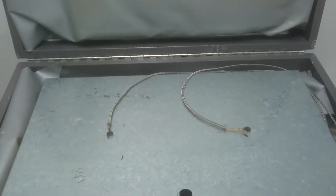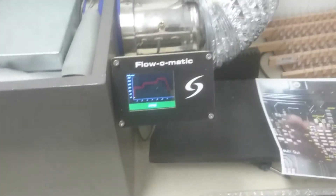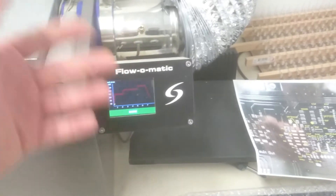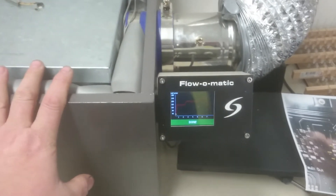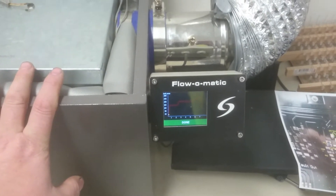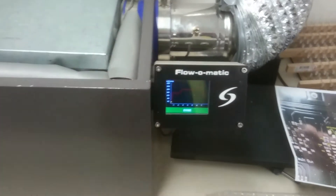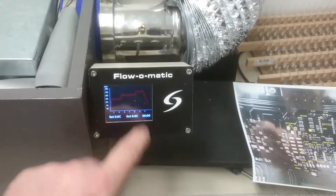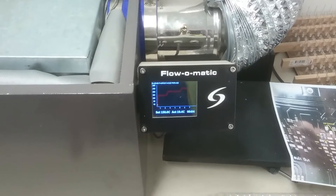That's just about it for the heating element. Here, we built a PID control for this because we had these little touch screen modules. I just used a couple of thermocouple interfaces. But don't get too hung up on that — you can buy reflow controllers online; you might as well do that. But we had these, so I made it. And in this case, I just attached the screen and off we go — it starts following the curve.